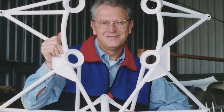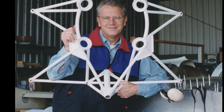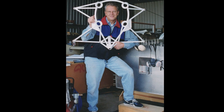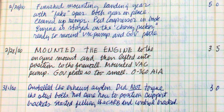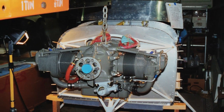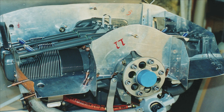Engine. N116 Bravo Whiskey isn't a glider — it needs thrust in the form of a gasoline engine and a propeller. For me, that meant buying a Lycoming aircraft engine. Some builders have used automobile engines and made them work, eventually. I wanted something proven and reliable: a Lycoming O360 A1A. Today, with used or rebuilt Lycomings, it's almost impossible to find. A new engine will cost about $22,000 — the cost of a complete automobile. The simple answer as to why: the engine is based on pre-World War II technology with little change.